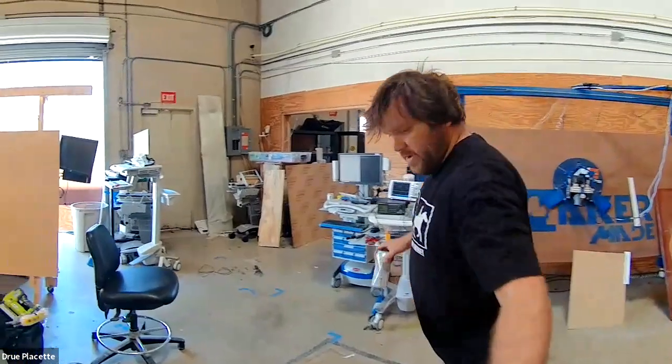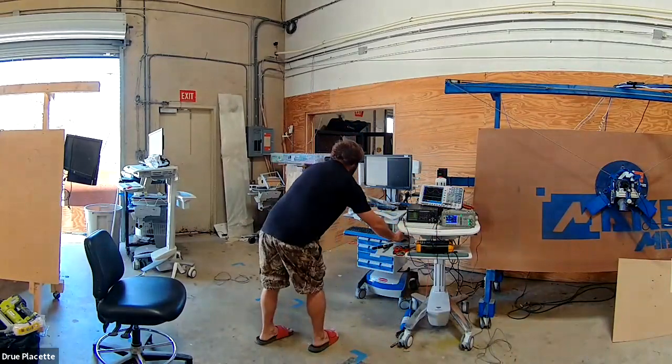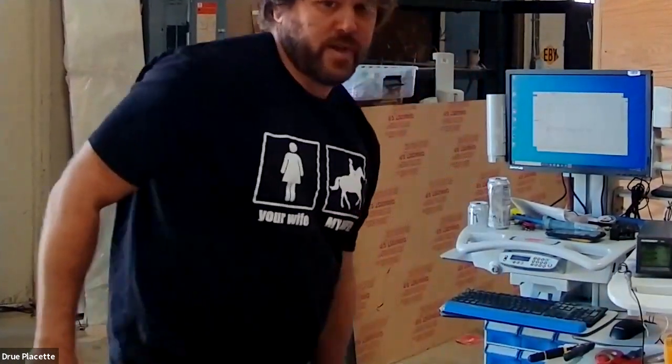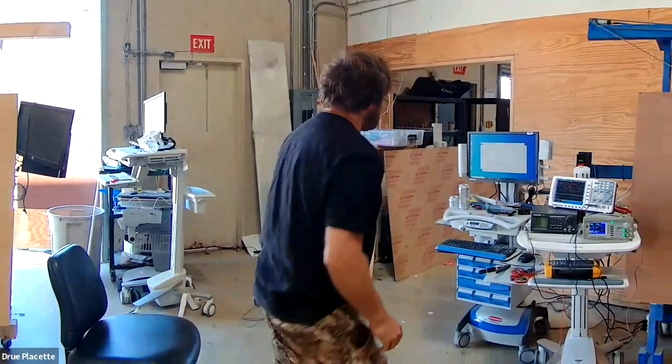Sorry, how do I change that back, or how do I get that working again? So if you look and see what COM ports it's showing right now in Device Manager. So in your computer, it's showing up as COM 4. It's showing up as COM port 4, yeah. Okay, so then just in Makerverse, just set it.